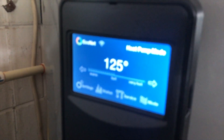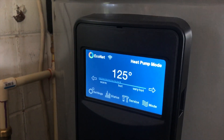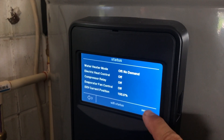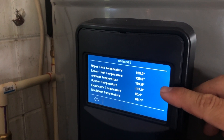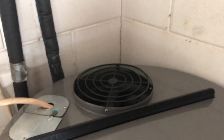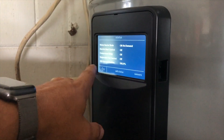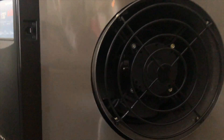I've been really impressed with this thing. I've got a video I'll make of how it works on the phone. Here you've got a little touch screen — it's off right now. No water coming out, check your sensors. It's set at 125, so it's in the 120s. Temperature in the garage is 104 — we're in Florida. Evaporator temperature is 90.4, discharge is 101 — that's because it's off. Hot air comes in here and it runs cold air out here. Let me crank this up — there we go, it's on.